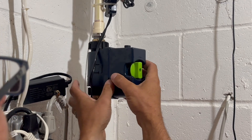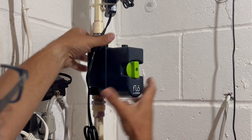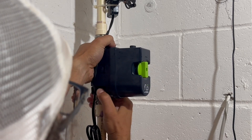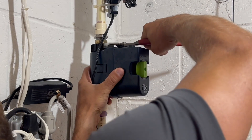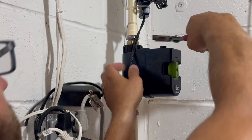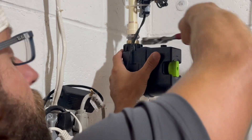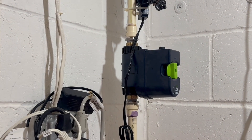The biggest thing is making sure those O-rings are still there when you tighten it — although you'll know if they're not because it'll leak right away. Get it finger tight, and I'm talking an eighth to a quarter of a turn with these — just snug. Don't be tempted to overtighten these, because you'll bust them off and turn this into a much bigger job.